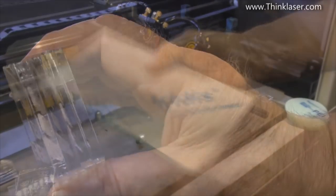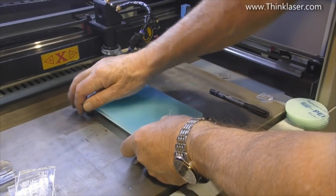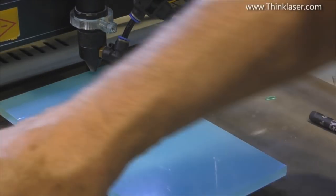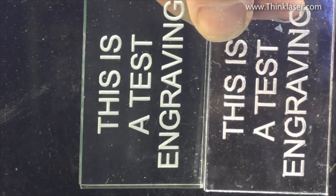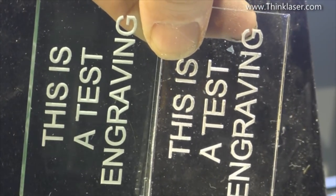If you really want some deep white text on extruded acrylic, not only do you keep the tape on, but you also add air assist - the air assist will drive the vapor back down into your cut and make it nice and white. Now let's take the film off and examine our results, taking the crud off as well. We should remove the centers of the letters too because they tend to get stuck in. The bottom one with air assist is a little bit stronger; this one is a little blotchy in places.